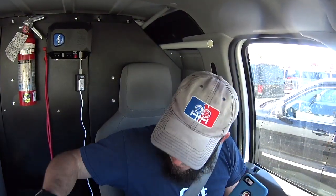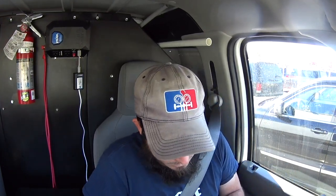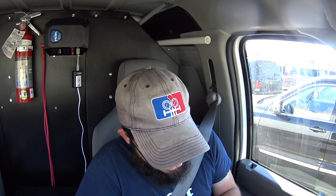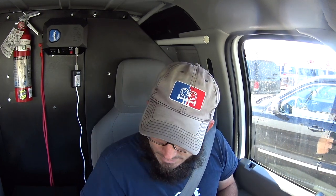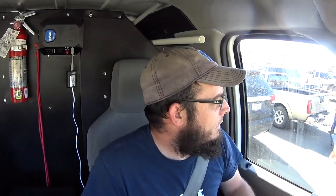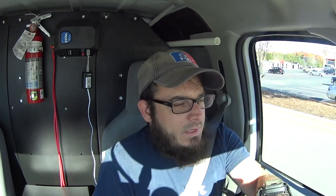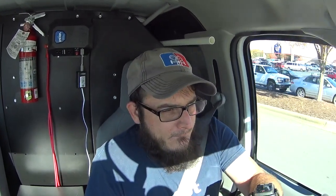Good afternoon. We've got our materials for routing that wire back to the back. We're headed back — only a few minutes away, thank goodness. It shouldn't be too terrible, other than I've got to go all the way to the back of the crawl space and punch a hole out, then route the wire up the outside of the house. I've got some rigid conduit so that I don't have to fight with flexible conduit, not to mention the potential for flexible conduit to be damaged outside.